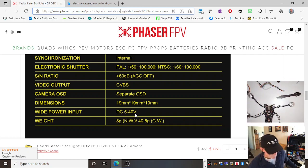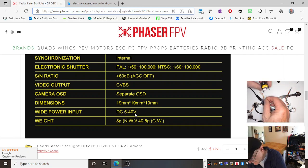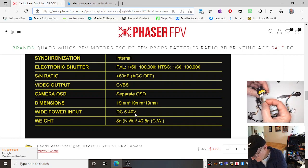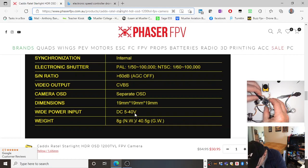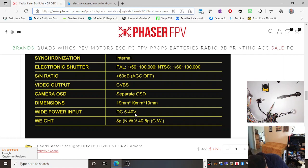Got to be aware of how you're going to power everything, because whatever you buy might not handle the power. From your flight controller board, it's being powered from here. Red, power, black, earth, yellow signal. And that's hooked up just to my camera. So my camera outputs, it's got ground, it's got VBAT. Yeah, VBAT, ground, and then camera 1, because you can have more than one camera.